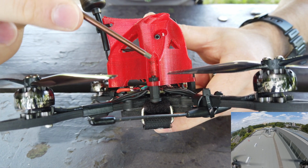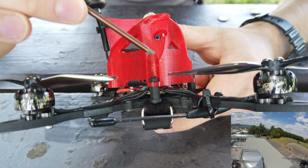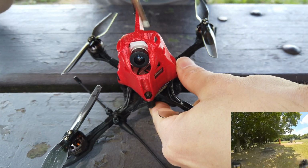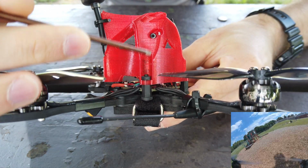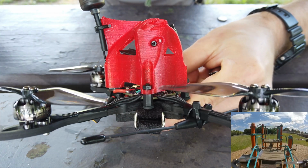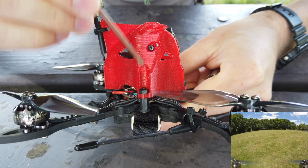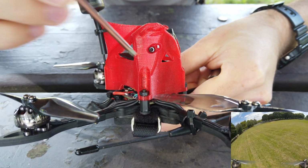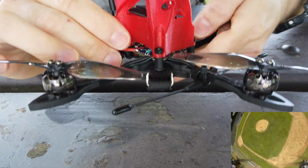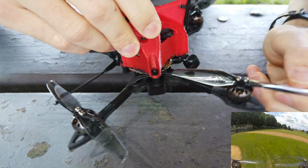It's like a little cylinder of TPU print. If you get an M2 20mm screw, you can use the 20x20 mounting holes that come with the Vista, and you use 2 screws, one on either side here, and you can screw it directly into the TPU. I found it difficult to do as is because the hole is already very, very small. So it helps to take an M2 drill and re-drill those bosses out so that you can actually find the hole as you're securing the Vista unit into the pod. And once you get that sorted out, you can leave the wires pretty long, and they all bunch up in there, and it provides for a very clean build.